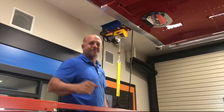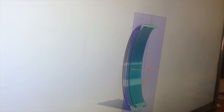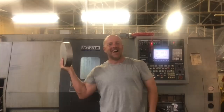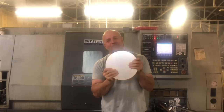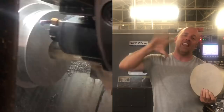There are actually two pieces. I've got them green and silver. This is to hold the new light assembly I'm building for Draco. There's a cross section pulled up so you can see how they overlap each other — this area is where I pinch the light, and right here is a step where I pinch the lens. I've got to make a dome circular lens for this. The light will sit pointing that way. This back step is for the carbon fiber attach point where I blend to the new wingtip. It's almost 1 in the morning, and we're going to turn this 18-pound solid block of aluminum round bar into a part that weighs a few grams.